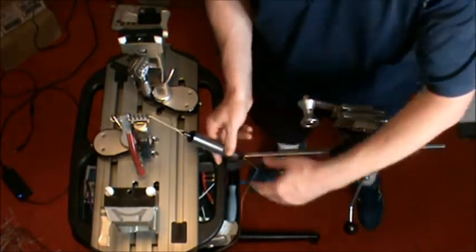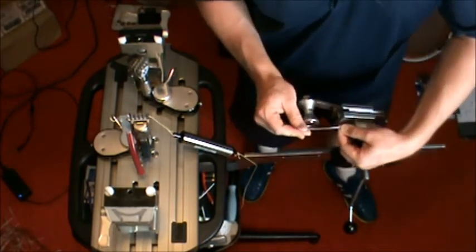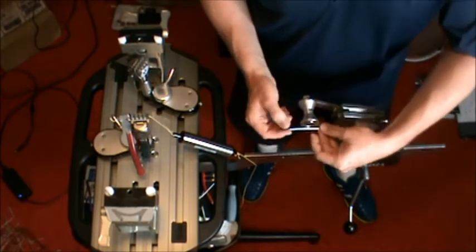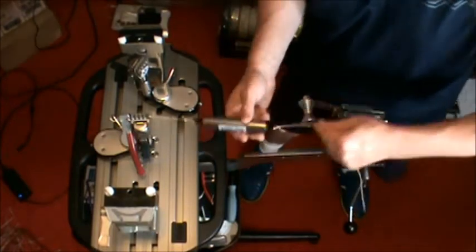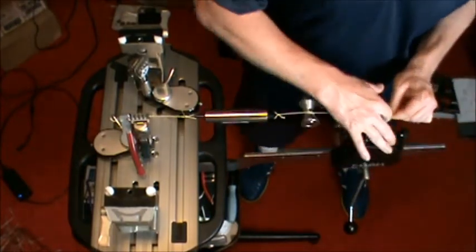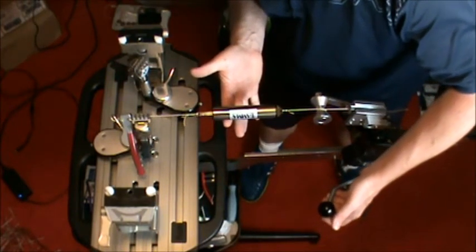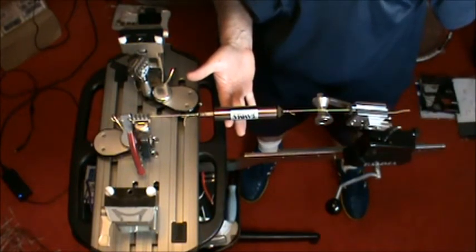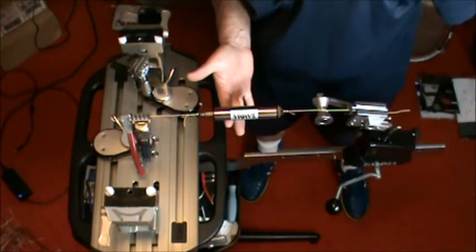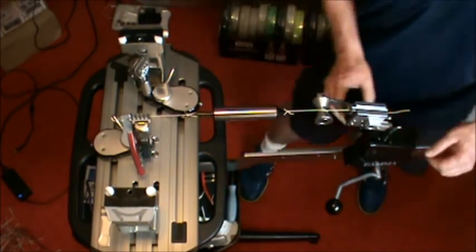So we just release it from the tension head, take the 3mm hex wrench, and we're going to turn this counterclockwise just a tiny bit. So I'm going to turn this maybe a quarter of a turn, and then we're going to check again. And let's see if I can even see. Okay, so it went past the mark that indicates 35 pounds, but it is not quite to 40. I can see the edge of the actual digit 4, but I never actually saw the little white hash mark. So we're close, but not quite there.